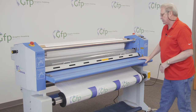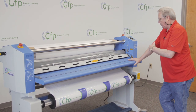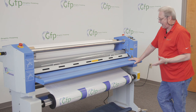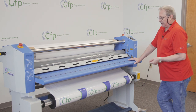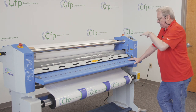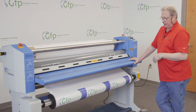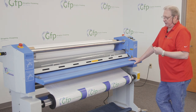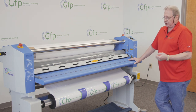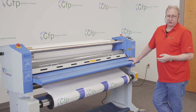This is a top heat assist machine. To help reduce silvering as the machine is running, I'm going to add a little bit of heat — not a lot, we'll take it up to about 95 degrees. What that does is it softens up the adhesive, which allows it under pressure to get down into the valleys of the inks and toners, whatever type of media you're running through the machine, so that silvering is reduced right away. Instead of a day or two for all the silvering to go away, it's usually gone in 15 minutes to two hours.